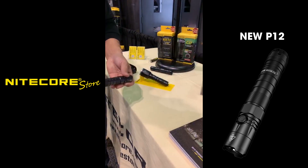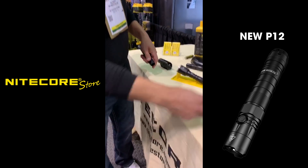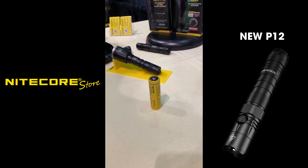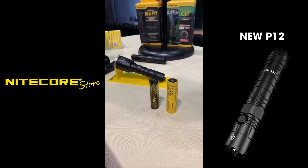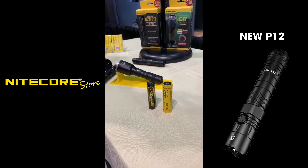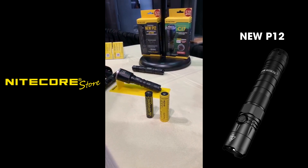What's unique about this flashlight is it is utilizing the new 21700 batteries. The 21700 battery is a little bit bigger than the standard 18650 that dominates the market right now. The 21700 battery provides about a 50% capacity increase over the maximum of what the 18650 will do.